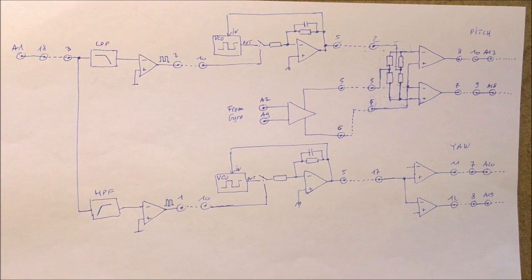On the ground, the guidance computer receives that signal using probably a four-quadrant detector. So it is possible to know the angle between the missile and the target. The guidance computer sends the steering signals to the missile using the two wires, and the missile corrects the flight path in order to go to the target. This is the general functioning of the missile.